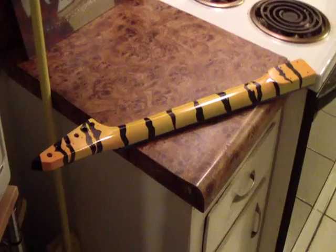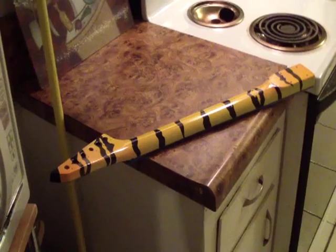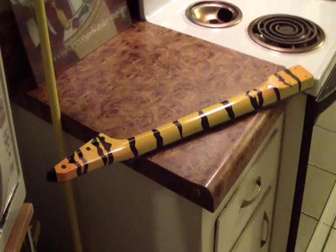So that's getting done. Everything's looking really good, so I'm going to close the doors on this. In the kitchen I got the neck. Basically, I set the neck down on the trash can and sprayed it with glaze, this stuff, and it's all sitting very well. Here's the neck right inside my door. The neck's waiting to get its second coat — I'm going to do about four or five coats on this. This is different than the holographic flake guitar because with the holographic flake you have to stack up, but it seems like the flake in a custom paint job like that absorbs the clear coat and it pulls it in and leaves dents.